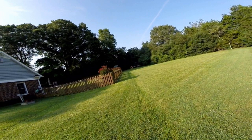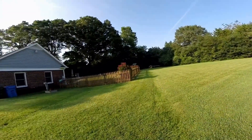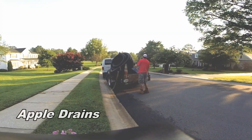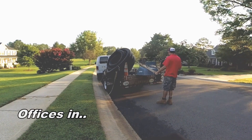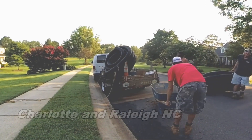But it's not. During a big rainfall event, the two four-inch pipes only fill up about halfway, so really it's still only a four-inch pipe running. A six-inch pipe is much better and moves a much larger volume of water. Six-inch pipe is really the best way to go on this job. We could have run two four-inch pipes, but it really doesn't have the same volume as a six-inch line.